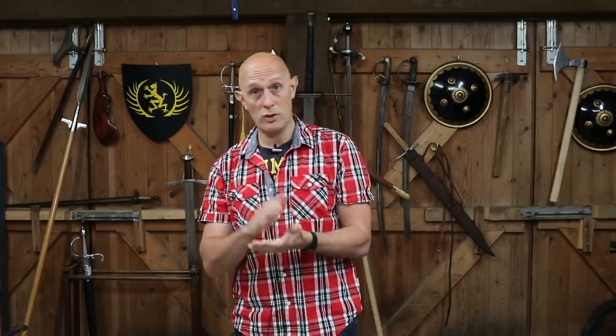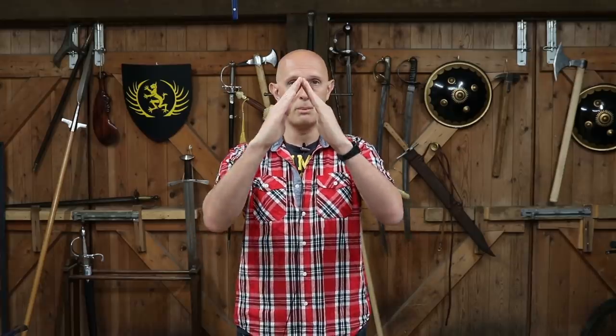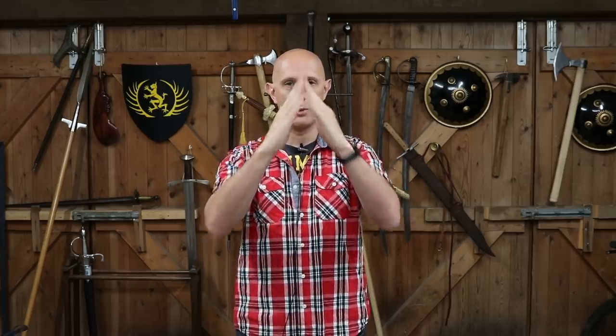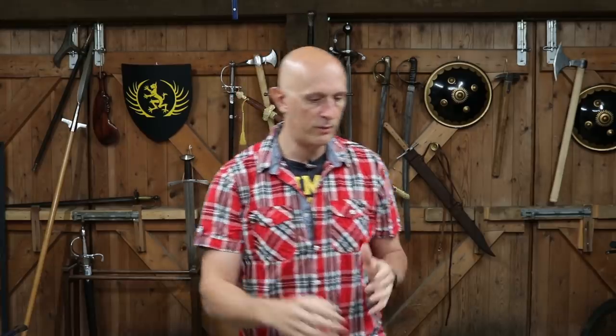And this is how most, not all, but this is how most medieval European sword edges are formed. They are either a direct bevel to the edge, okay, so just one single bevel, like a chisel, or they are hollow ground, so they actually bow inwards and then come to a finer edge, okay? And what we don't usually see with medieval swords is them coming to almost an edge and then having a secondary bevel in the final bit.